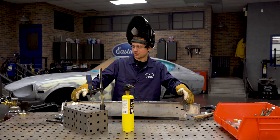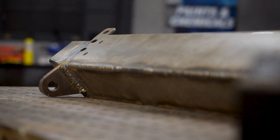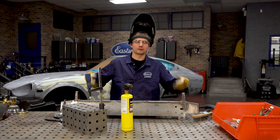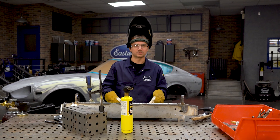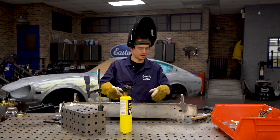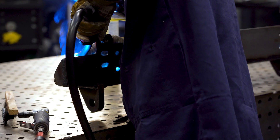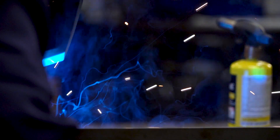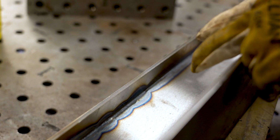We've got these D-ring tabs welded on as best as we possibly can. They are hot. We've got multiple passes on both sides, and we're also going to flip it over and weld the back side. We had done some with the TIG-200 already, and we still need to finish up with the MiG-90. We got really consistent penetration all the way across — it did a great job, real consistent. We've got a little bit more to weld up and then we'll be done.